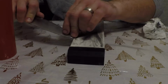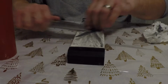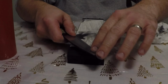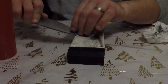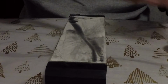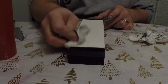Anyways, getting into sharpening, I started with 500 grit and killed the original edge that I had put on it. After getting a burr on the Shapton Glass 500 on one side, I flipped to the other side. It's a very self-explanatory process that I've gone through on all my sharpening videos. Just going back and forth until I have a very even edge and a minimal burr. I try not to form a huge burr. The 1084 formed a burr very quickly. The whole process took me about 18 minutes roughly, and I took my time with it.